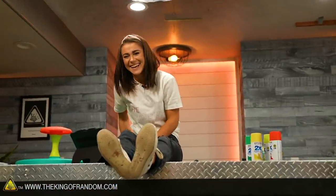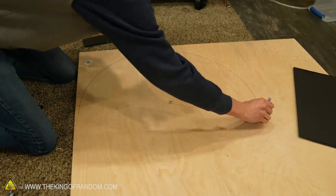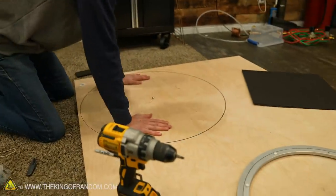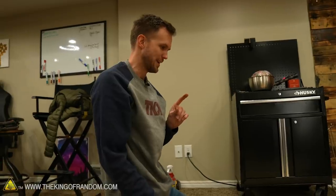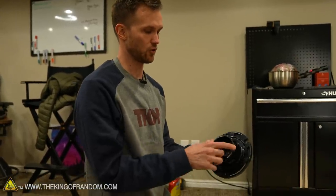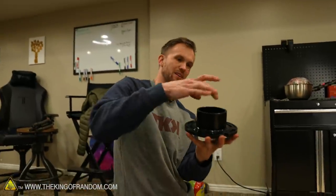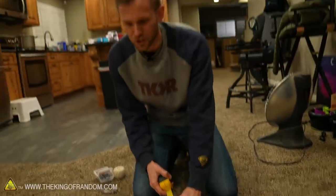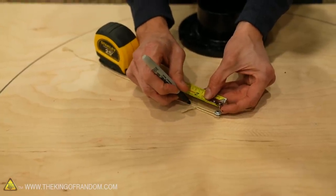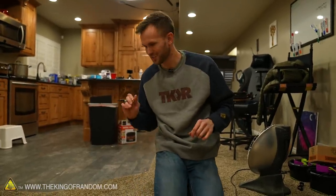Pivot! I want it to be 30 inches in diameter, so I've got a 15-inch string — that's going to be the main base, the part that I sit on. We also need a hole in the center for the control mechanism — the tower that sticks up, the light green part on our toy version. We're going to use some ABS plastic; our three-inch ABS plastic pipe is going to fit into this flange. I need a circle the size of this base part of the flange marked out because we're going to have to cut that hole in the center — almost four inches. So if we have a four-inch hole, that would work great. We just want a little clearance.